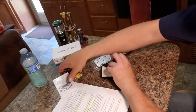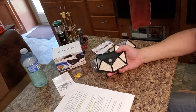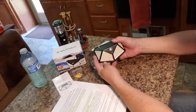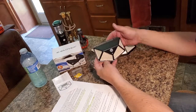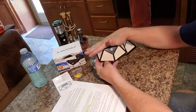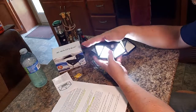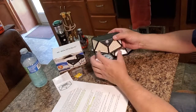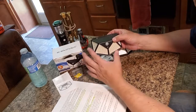There's also an instruction manual regarding the modes. They have basically three modes. Click once, it blinks once — that's the standard motion mode. During the day it doesn't pick up motion, but at night it will pick up motion, stay on for roughly 15 seconds, then turn off. Mode two blinks twice and adds a night light mode — similar to garden lights — at a much lower level, probably around 30 to 40 lumens, so at night they'll turn on in the low glow and trigger the high mode on motion.